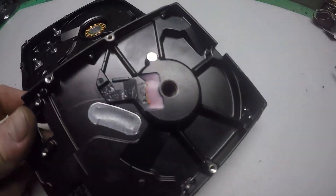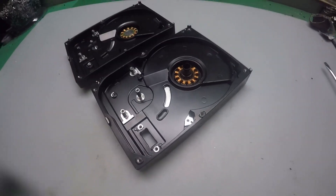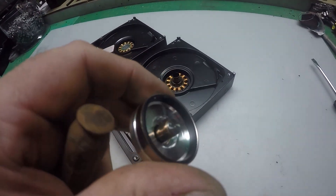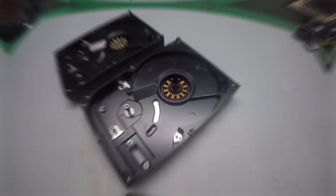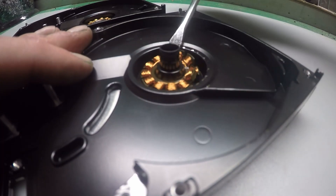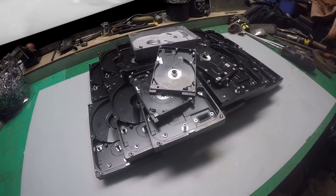Remember I was saying we had to knock the motor out — I used a punch, put it in the vice and banged it through, and you get the top casing of the motor released. That's aluminium, but it will be classed as dirty because there's a ferrous magnetic band on the inside of it. Just a case of popping these off — put a screwdriver underneath, bend it up a bit, and voila.